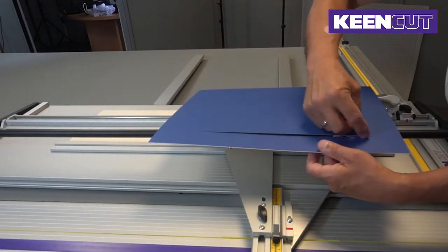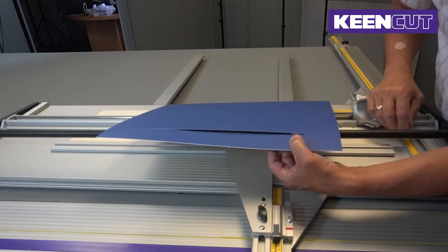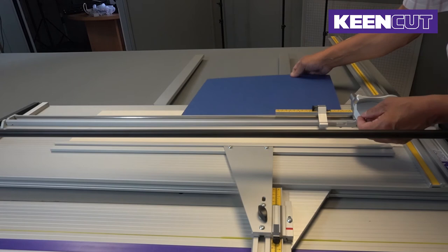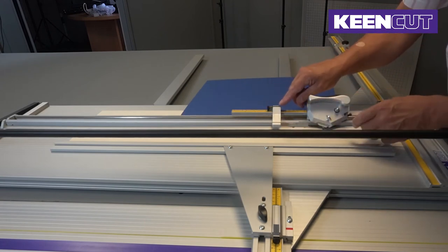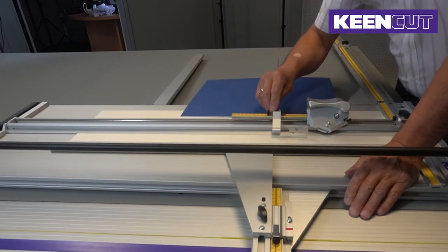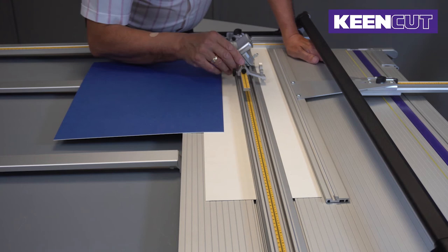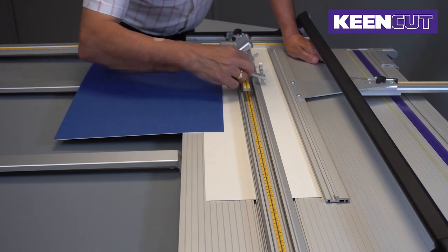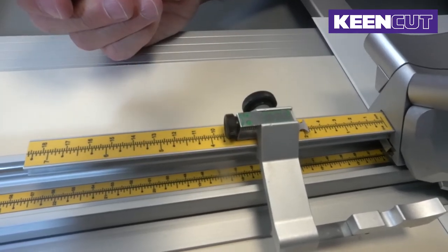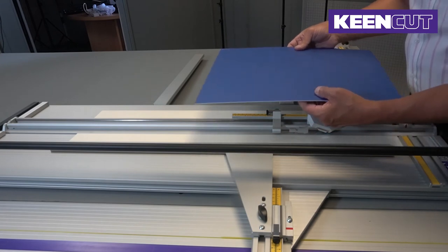The start comes down here. That distance there — which I'm guessing to be three millimeters — is an undercut. So we need to extend the length of the cut by three millimeters. On the knob we have a plus and a minus, so I want to turn it in the plus direction by three millimeters, which you can measure on either scale. Between one, two, three millimeters — you can get a rule on it, but usually doing it by eye is enough.